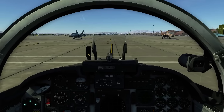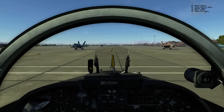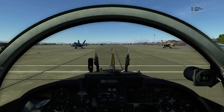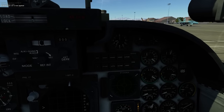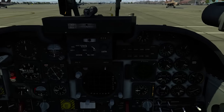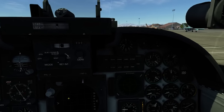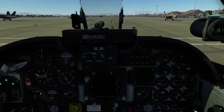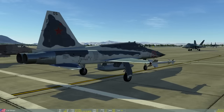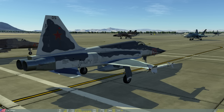Now we'll go ahead and get the right engine started. Go back to the radio, ground control, F8, air supply, and apply. We'll repeat the same process — wait until about 1200 RPM, move the throttle to start idle, and hit the starter. Move the throttle to start to roll. All right, hang tight.